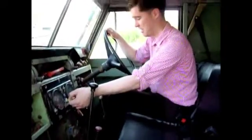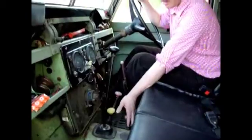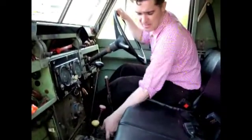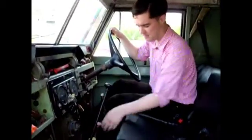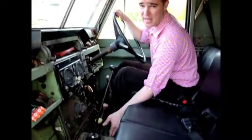We then will need to turn the engine on. What we do is drop the clutch and pull out the lever to engage the PTO. Then engage fourth gear, bring up the clutch — the PTO is now engaged.